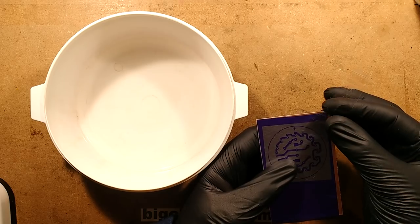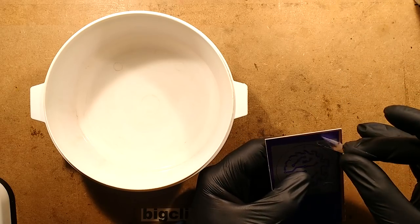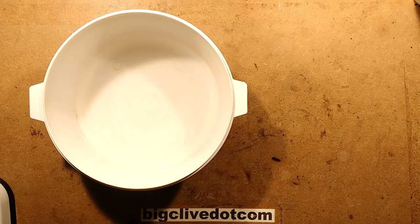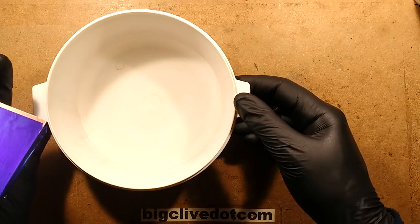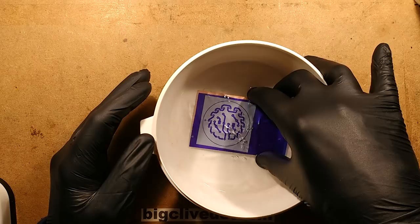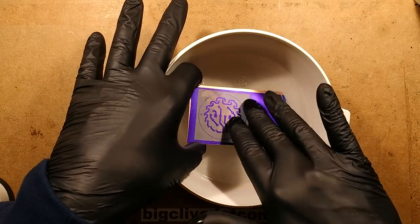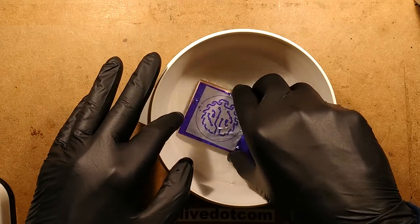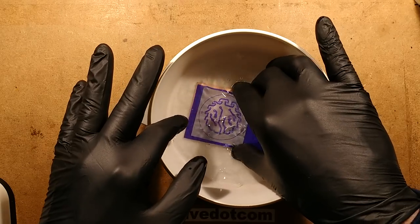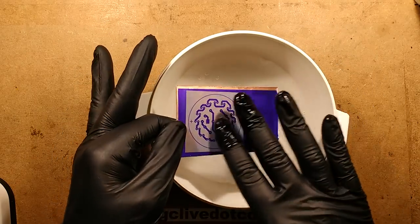You have to put another bit of tape on and peel off the top protective coating. This solution has been made with just four grams of washing soda crystals in about 125 millilitres of water. I've got gloves on just to protect my fingers — it's not that caustic but you don't particularly wish damaged skin. Now I'm soaking it and you have to rub it — this is very different to the older developers where it just washed off. You really have to actively encourage it by giving it a rub with your finger, or a brush can help as well.